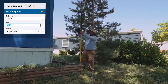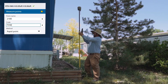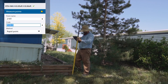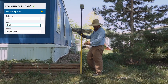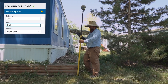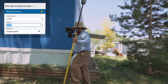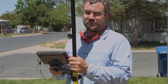When I want to get this and the level bubble's up above my head — I just type in the code, top of the wall, shoot it. A lot of times these walls are not straight up and down and you have to kind of fudge it to get it right, but here you just put the tip right in at the bottom of it and you get a good measurement. As far as how much time I'm using it in tilt mode, I would say almost all the time — over 99% of the time.